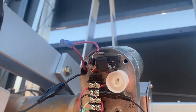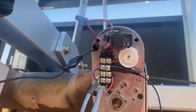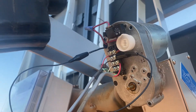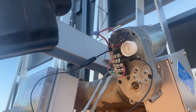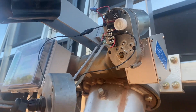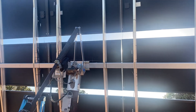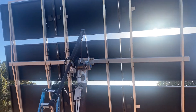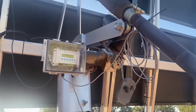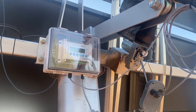For some reason the easterly direction limit switch burned out — burned out the diode — and I don't know exactly why. Anyway, I'll be replacing that and recalibrate the limit stop positions for east and west. Hopefully this thing will be back to a worry-free setup. It's all kind of new to me, just learning as I go, but with a basic knowledge of electronics and mechanics it's pretty easy to work on this stuff. Thanks for watching.